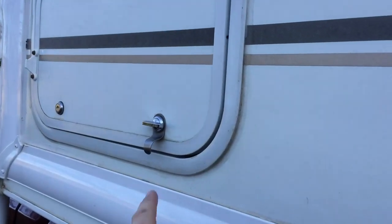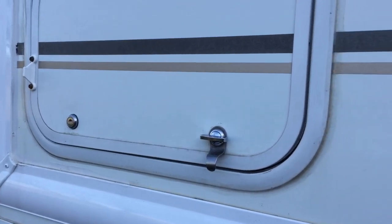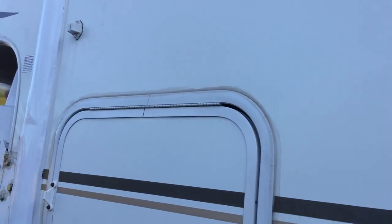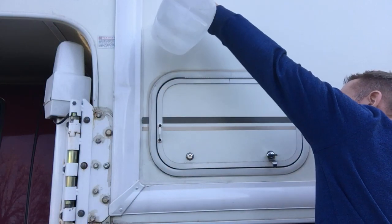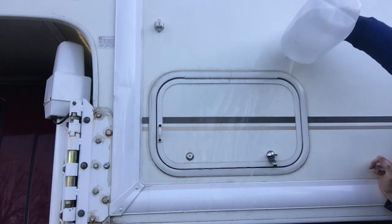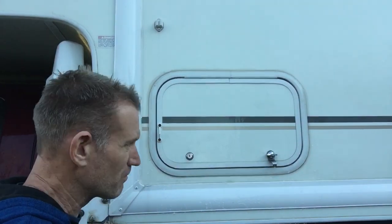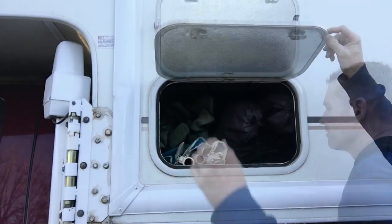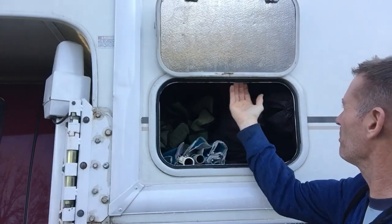So I've adjusted both of the strike plate things and the latch, making sure the door is sealed all the way around. I'm going to go ahead and pour some water up top and check for leaks. That worked — nothing's getting through on the top. It's all dry up here and nothing's getting through to the inside of the frame.